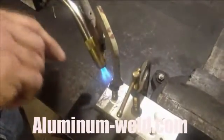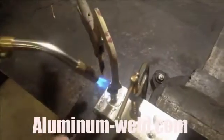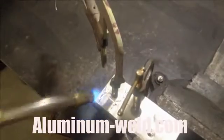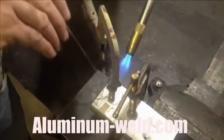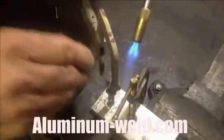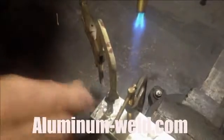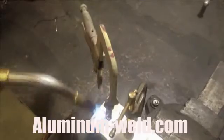The reason we can do this is the rod sticks to everything a magnet will not stick to. That's a steel bolt in there. Now we've got that a little bit filled. Make sure you work it in around the threads because the rod doesn't flow. I think I got it in there pretty well. Now we're going to let this cool. When it cools we'll take a wrench, break it loose and have a brand new set of threads.